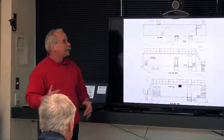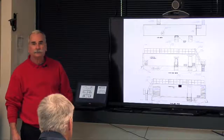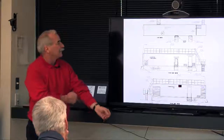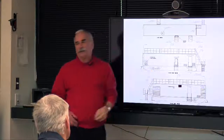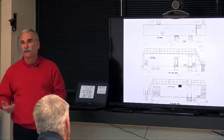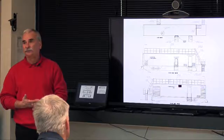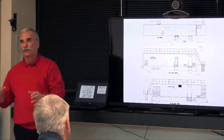On the curbside of the trainer, we have a ship's door or six-dog door to make entry through. That will go into however you want to set up the maze inside — narrow spaces, items like that. Up at the front area, we have a control room with the major electronic components like the PLC. This is where you will start the unit up from, and you can monitor temperatures and gas levels. You don't have to have somebody in there full time — staffing the fire ground is up to how you set up your SOPs.